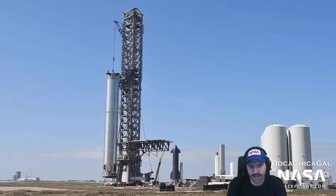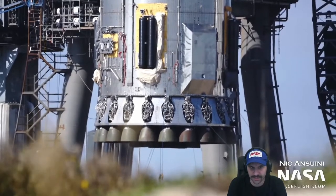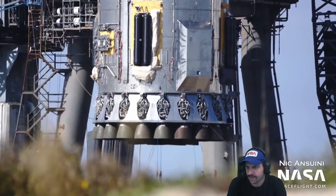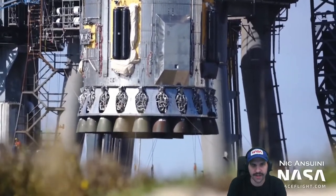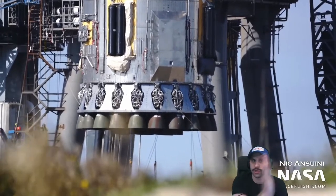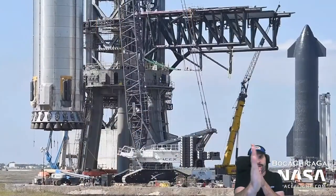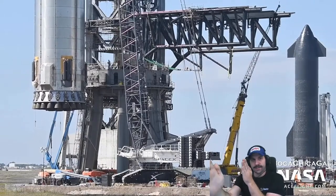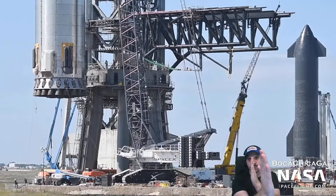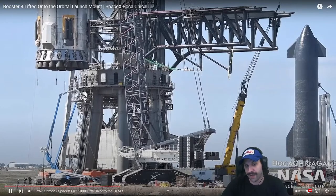No camera on top? No, you have sensors up there. That's insane. How much can you do as a person to counter the swing with the cables they have? You'd be surprised. Those guys with the tag lines are damping out, making sure the thing doesn't sway, because you don't want deflection. If the payload isn't perfectly coplanar with the boom at all times, and it goes this way, it's going to twist the boom. Torsional load.